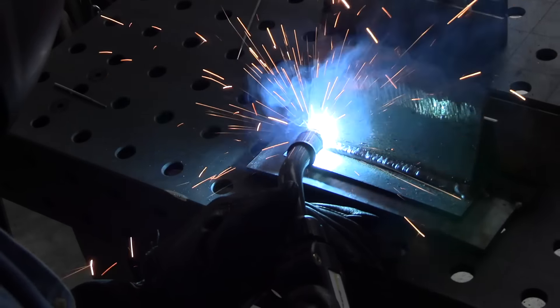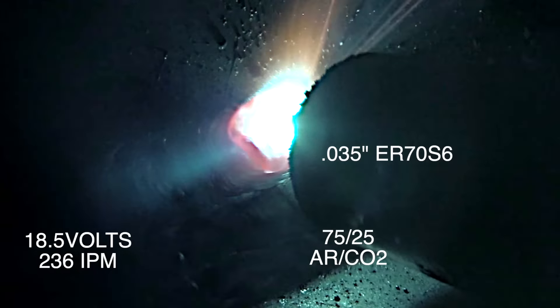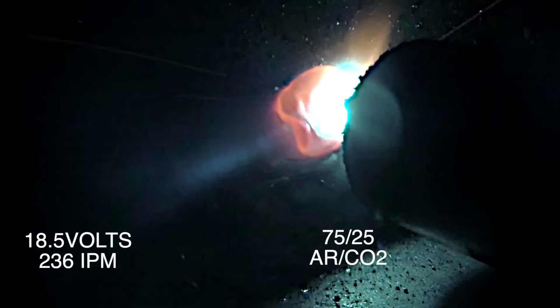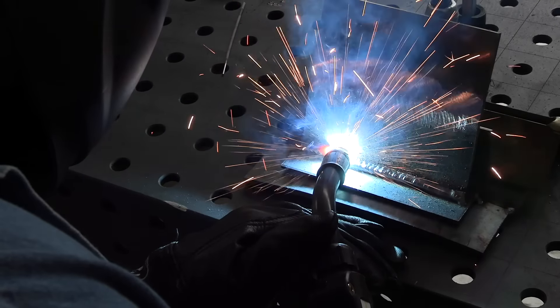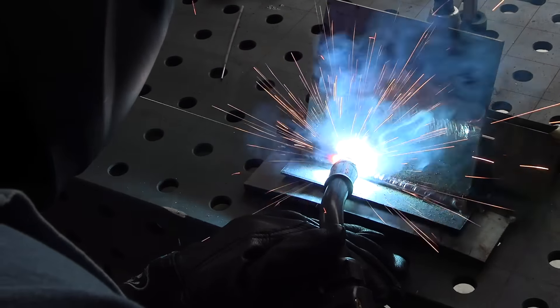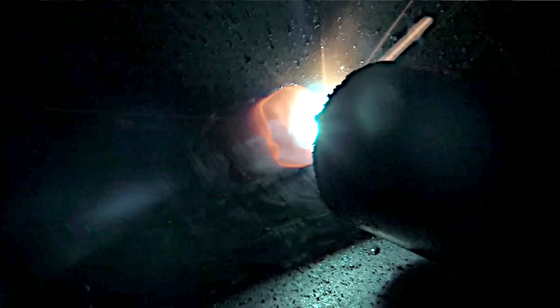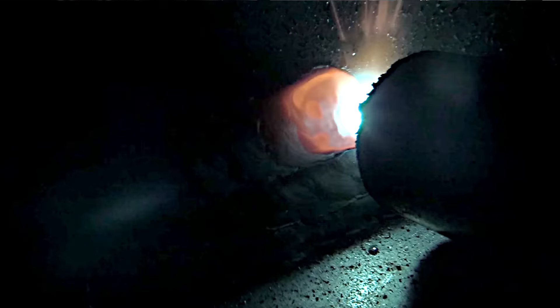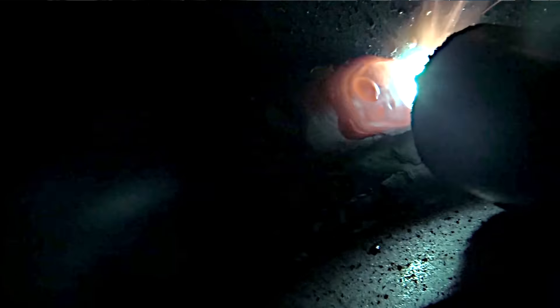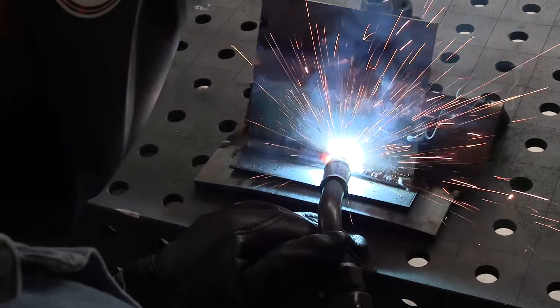We are going to be doing both pulling and pushing today. The key is not to get carried away with the angle. I've tested a whole bunch of these welds with both pushing and pulling, and the key is to only use a slight push and a slight pull, or a dead nuts 90 degree angle. I think a lot of the time when people are adamant that you should only push, they're talking about spray transfer. This is short circuit MIG — a slight pull angle works great.